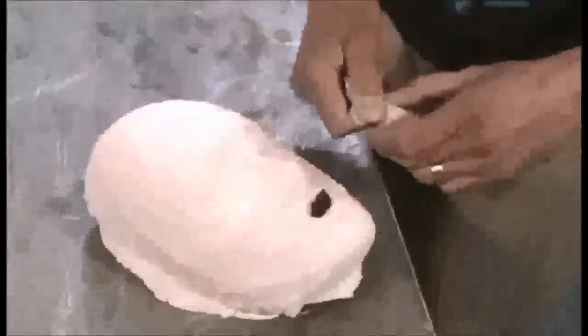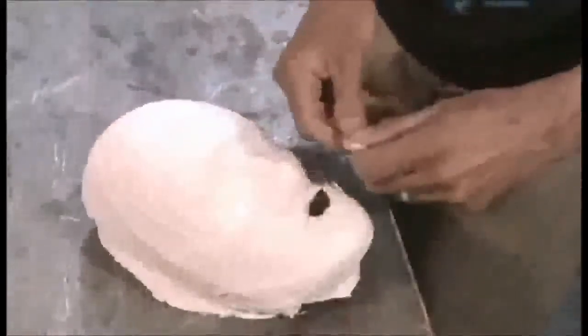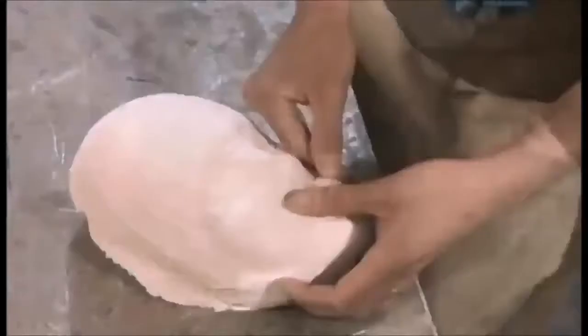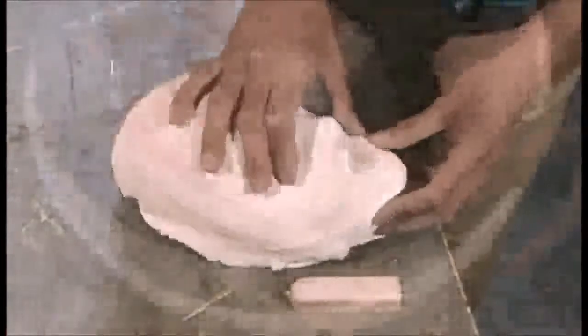These masks allow the goaltender to play it safe, so they're far less likely to be sidelined by a serious injury. Production begins with a plaster mold of an average person's face. The mouth hole is plugged with plasticine. This ensures that the mold won't leak when it's filled with plaster of Paris.